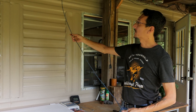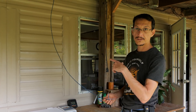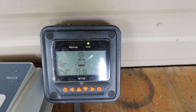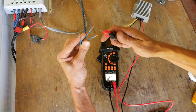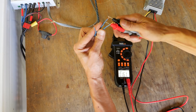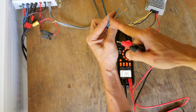I got the wire pulled from the battery center to the freezer. Since this has three conductors, I have to figure out which one is positive and which one is negative. I'm going to turn the system on and put a meter on this and tag it. We've got 55.3 volts and we know that the positive is right and the negative is right because if we switch these, that little negative shows up. So those are the two leads — positive and negative. Don't use this one.